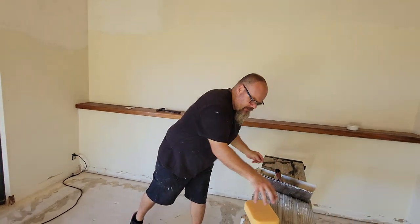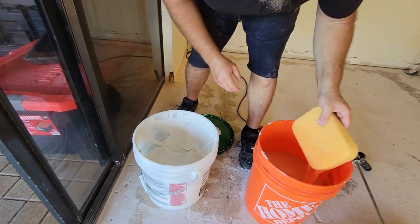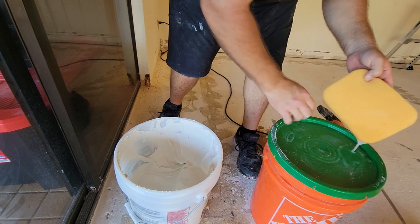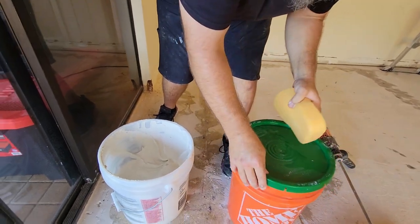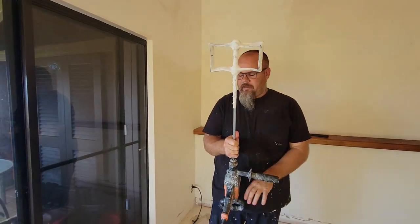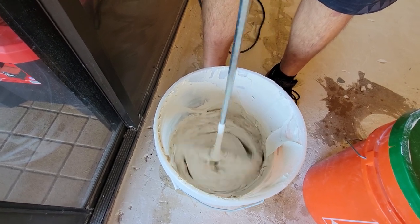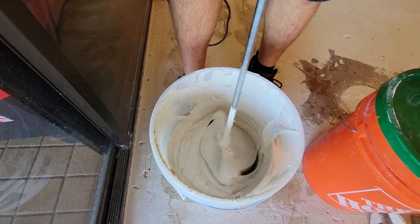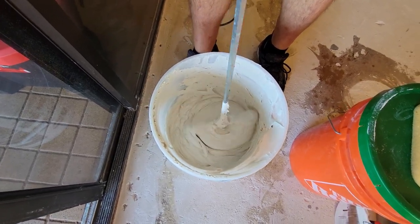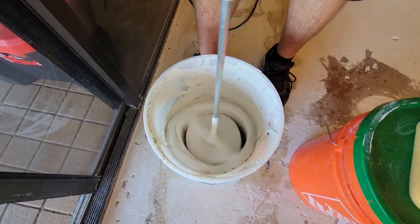It's got more glue. I like to have a sponge handy to get a little bit of water. I've already mixed this but it needs just a hair more water. You can always add more — just get a little bit. I want it creamy, but if you get it too loose, it's going to spill all over the ground. There's a key on how you trowel it on so you don't make a huge mess. This is the type of paddle I like to mix drywall mud. Start out slow — you're not going to start whipping it really fast or you'll whip mud and water everywhere. Start slow, then pick up the pace. I'll go slower near the edge of the bucket because I don't want to peel plastic and get chunks into the drywall mud.